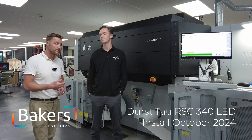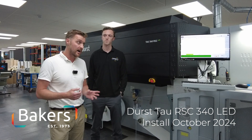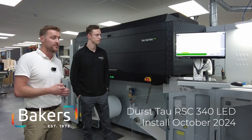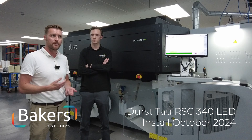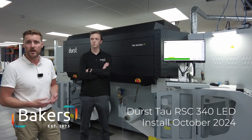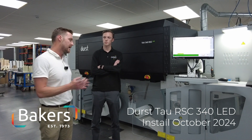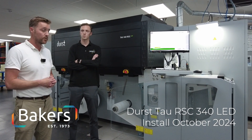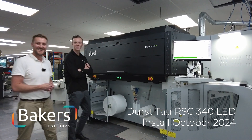Very exciting — I've been very impressed with the machine so far. The print densities across the web are fantastic; actually some of the best I've seen. We're seeing less than a delta E of 0.2 from one side of the web to the other, which is really accurate. It's going to help with repeatability of jobs and hitting colors correct first time so you don't have to correct them at all. With the press up and running now, we think it's going to be really good going forwards. Also helps that she's an absolute looker — she's a beauty.